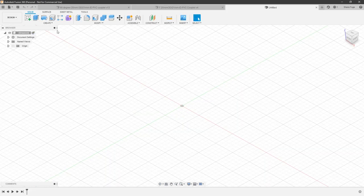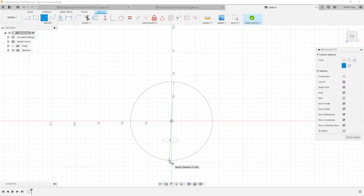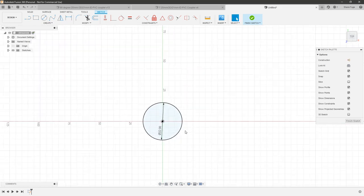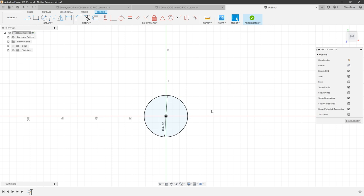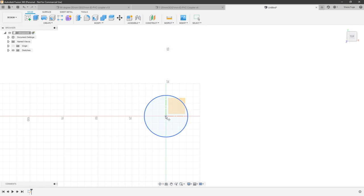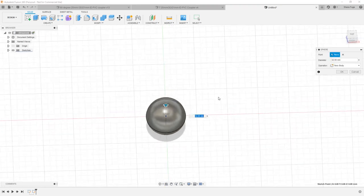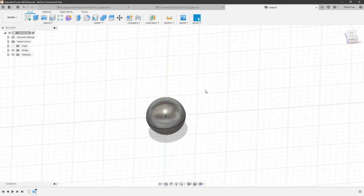So we're going to go ahead and create a new design. I'll do a new sketch, click right in the middle, and make a circle — I'm going to make this 32 millimeters. This just gives me a frame of reference for the project. I'm going to go up to Create and go to Sphere. I'll click on that circle, click right in the middle, and it pops automatically to 32 millimeters. Now this sphere is going to be what we call the joint between two pieces of conduit. We now need to make the connectors — the actual shafts to go on that.